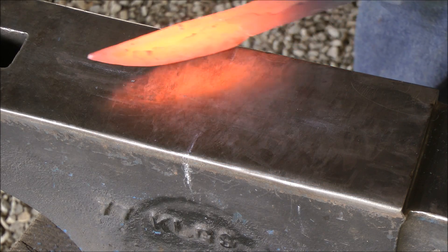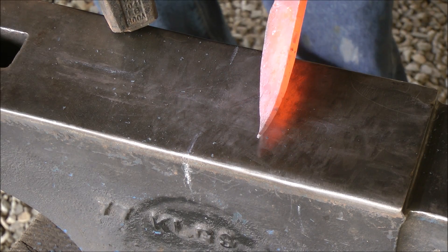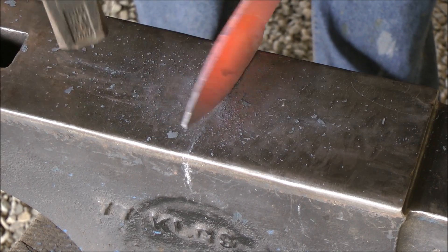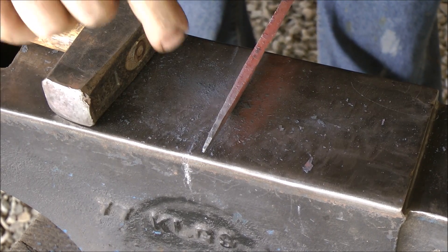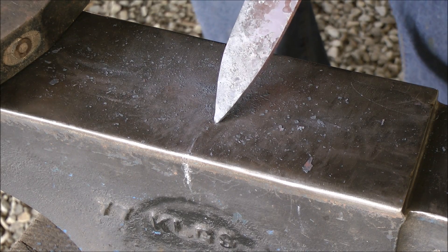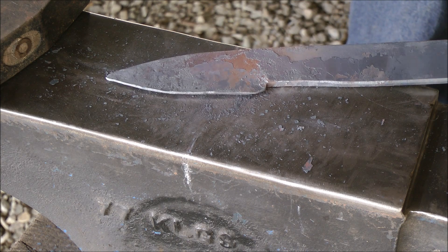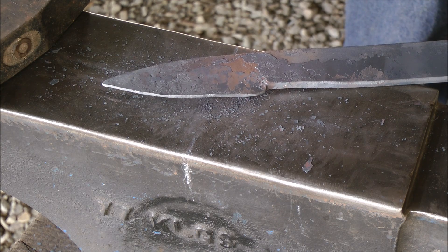What I now want to do is create a bit of a drop point. Blade is on edge and I'm hammering down — as you can see it's deforming, so then sorting out the deform. Going down a bit more, sorting out the deform. All I want to do is straighten the metal. Hammer it too hard here and you'll put a dent into your steel — we obviously don't want that. That tip has dropped a tad more. I'm almost back at a spear point and I must admit that I am liking that. What I'm going to do next is just clean up that blade, maybe bring that tip down a tad more.